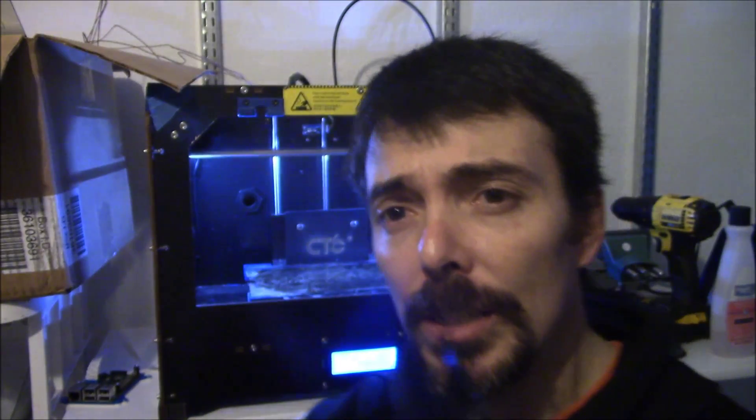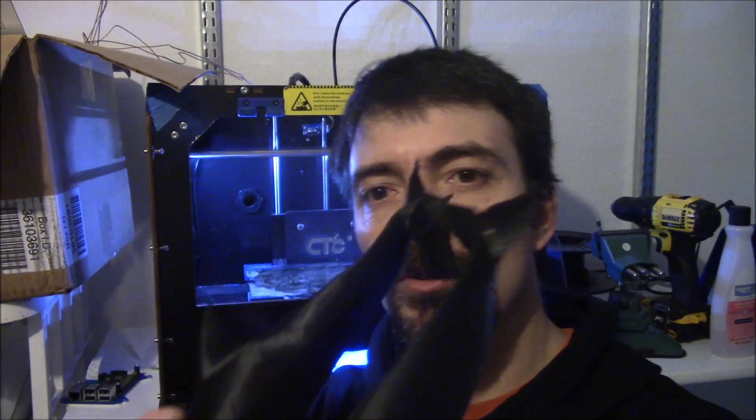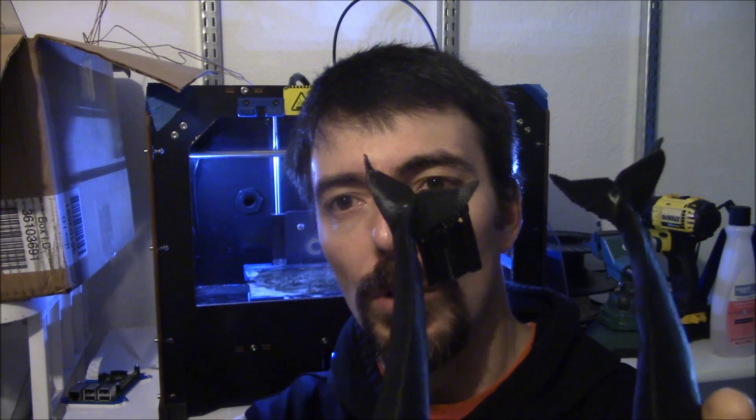To eliminate that, what you do is put two items on the bed. For example, if I was to print two dolphins, the head would move over to the second dolphin, move over to the second tail, and that would allow the other tail to have the opportunity to actually cool off. Then back over to the next one and so on and so forth.